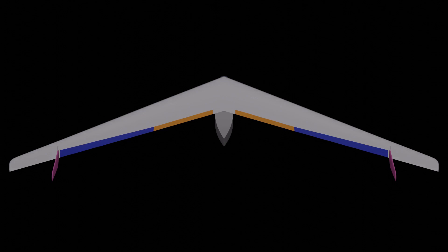So you can improve your low-speed performance and have a little bit of glide path control. To sum up: because it's foot launched, Raul went with a flying wing design. Because it's designed intentionally for good soaring performance, it's a fairly high aspect ratio, long wingspan flying wing. There are a number of considerations aimed at reducing tip stall issues and to make it a good handling machine. And lastly, it needs to be light enough that a person can pick it up and run with it — a strict weight budget of 100 pounds, which is less than some other rigid wing hang gliders out there. So the design elements here almost all revolve around the fact that it's foot launched.